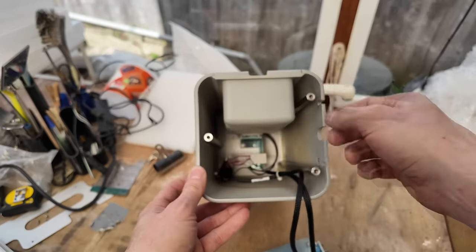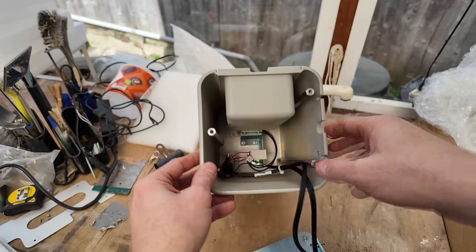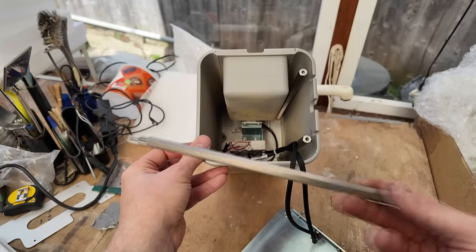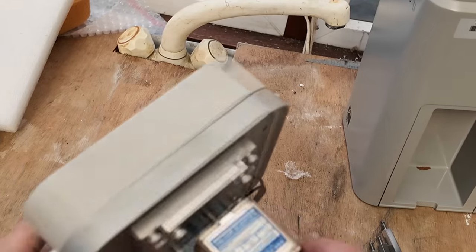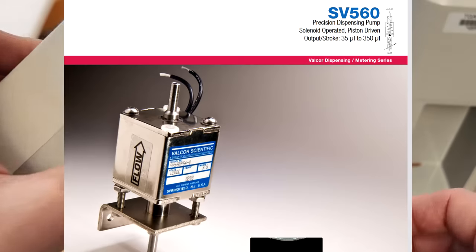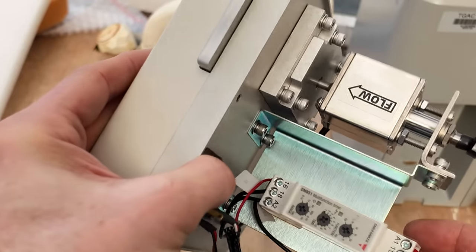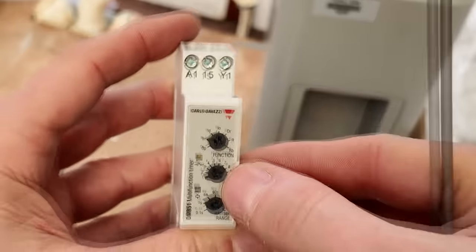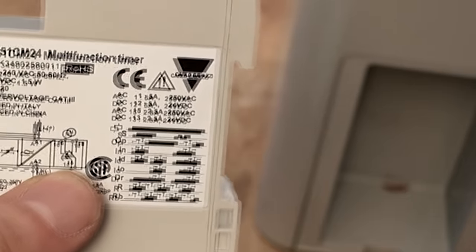Taking the bottom off — the outer casing is plastic, possibly heat-formed or the low tooling cost foamed plastic construction we've seen a few other times. There's a separate section glued in for the oil bottle, held down by some hilariously long threaded spacers. Inside we can see what looks like a DIN rail timer, and a rather fancy looking pump — I'd imagine this is designed to produce fairly precise volumes. I was expecting something like a peristaltic pump but it might be something different. The DIN rail timer is a fairly standard industrial building block for producing various timing functions, with several modes including cyclic, monostable, and various others.